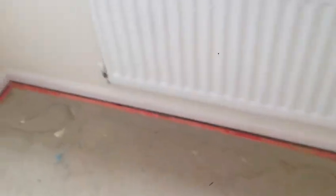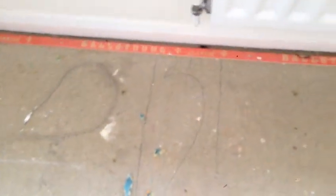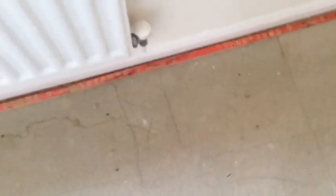I've seen a few colleagues drill through the pipes. If you drill through the pipes, you'll end up flooding — and the floor downstairs will need to be ripped apart until the tank is empty. So be careful when nailing. Always use screws — much better, much more secure.